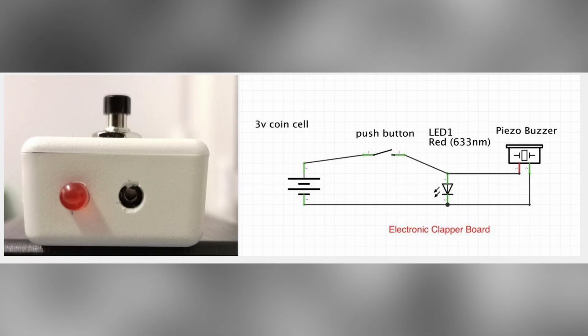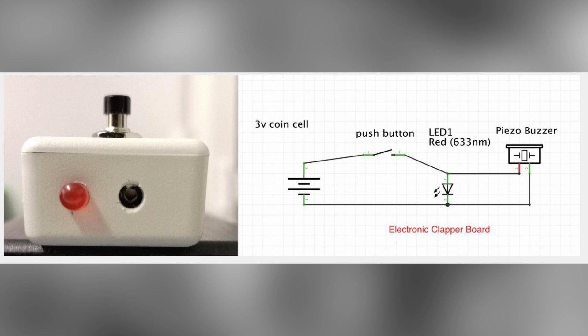To enable me to do that I built this little box which has a push button, there's a three volt coin cell inside, an LED light and a piezoelectric transducer. I put the circuit for that in my photographic blog and I've linked that in the video description below if you wanted to see the circuit. This works very well but there's only one problem — the button is exposed and quite often when it's in my camera bag it will bang against something and set itself off, or it will rest on one side and continuously beep.